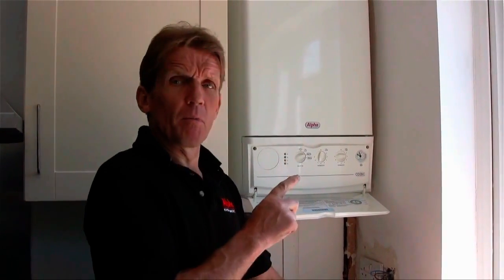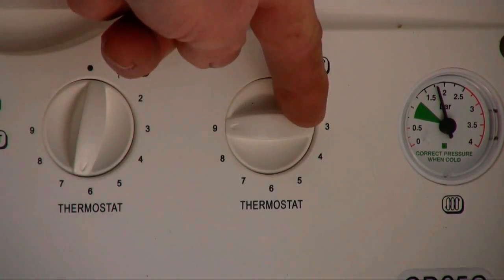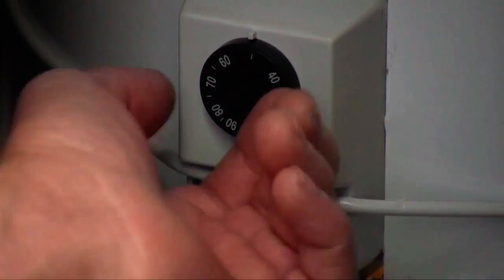The kitchen's fitted and the boiler's up and running. Before I go, I just want to show you a couple of important points. When commissioning the boiler, we set the temperature on the boiler thermostat to maximum so that the boiler is hotter than the FlowSmart. That means we can set the cylinder stat on the FlowSmart to a slightly lower temperature, avoiding a cycling situation - it's a standard setup as you would use with a boiler on a cylinder thermostat. I've set the cylinder thermostat on the FlowSmart to 75 degrees centigrade, which is cooler than the maximum temperature on the boiler, so the cylinder stat will switch the boiler off via the motorised valve in the normal way.